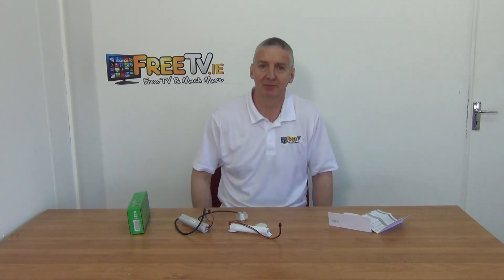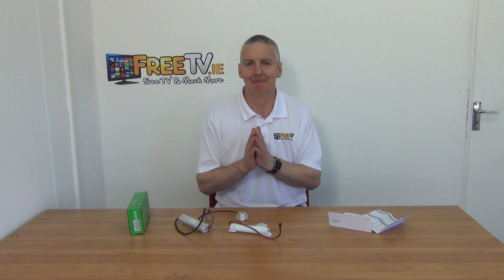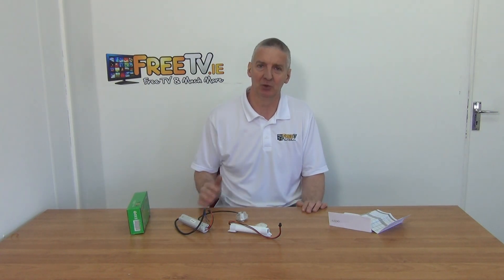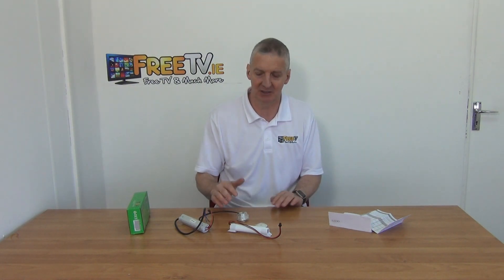So where would you use it? Well, say you have a scenario with hallways and you have panel lighting all the way down. You could build in battery packs that will allow the panel lighting, or a certain percentage of them, to keep running even in an emergency, but it's quite expensive to do it. A much more energy efficient and cost efficient way of doing it is a 1.5 watt LED emergency down light like this.